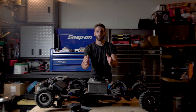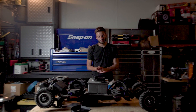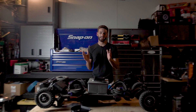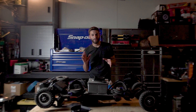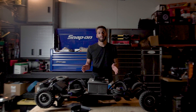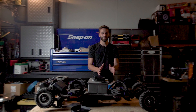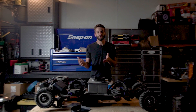Now you're going to need a set of batteries — there are a couple options. For myself I have three sets. The first set is kind of retired now; those were two five-cell batteries in series making a 10-cell battery, about 5,000 milliamps, which gave me roughly four and a half to five miles — really just not enough for this board. When you're going super fast, five miles goes super quick. Those were the batteries for my old, much smaller board. For this board I went with two sets of batteries for two different uses.